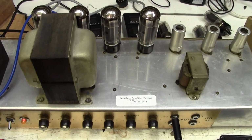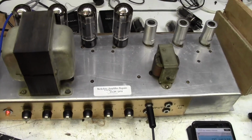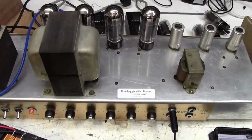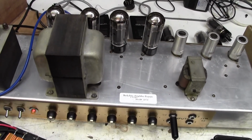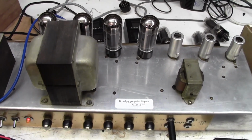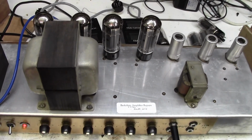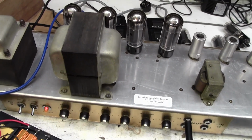I just remembered that the final thing I wanted to do on this amplifier was to wind it up to maximum and make sure it was giving 100 watts out and also wasn't oscillating. I didn't pick up on that oscillation thing again in the video. I forgot basically, but I think the earth strapping has also cured the oscillation problem. That's my view on that.